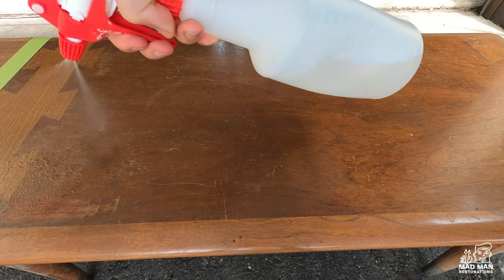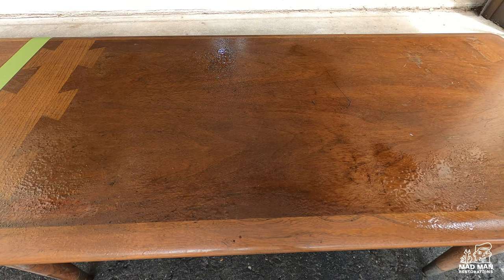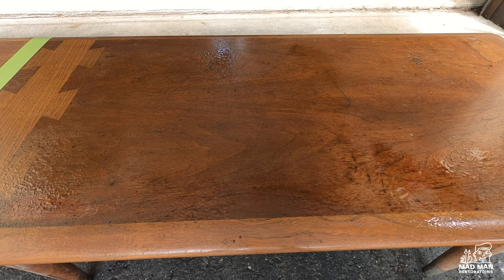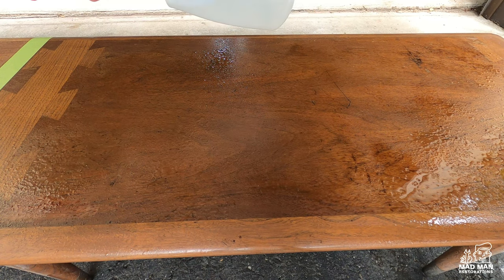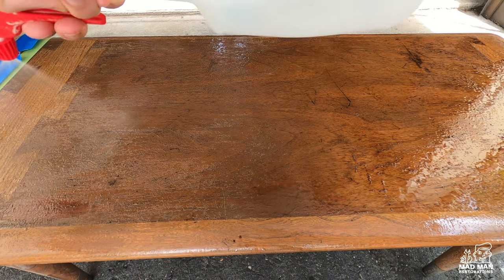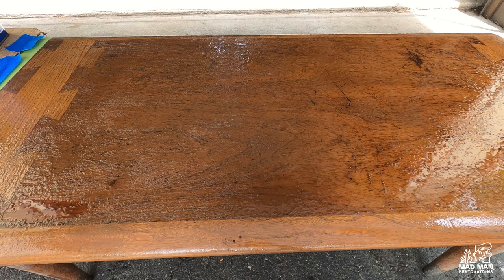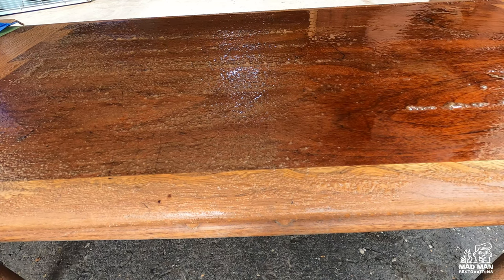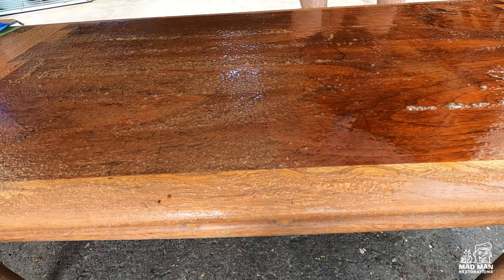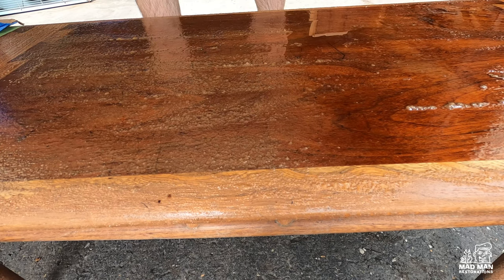The application for QCS is different — as you can see, it comes in a spray bottle. The directions say to spray the entire piece and check on it every 10 minutes, spraying more QCS as needed. QCS claims you can simply spray and walk away to work on other projects and not have to worry about the wood darkening like Citrus Strip. I waited a total of about 30 minutes before deciding it was time to scrape the finish off, spraying additional coats when the stripper looked like it was getting dry.